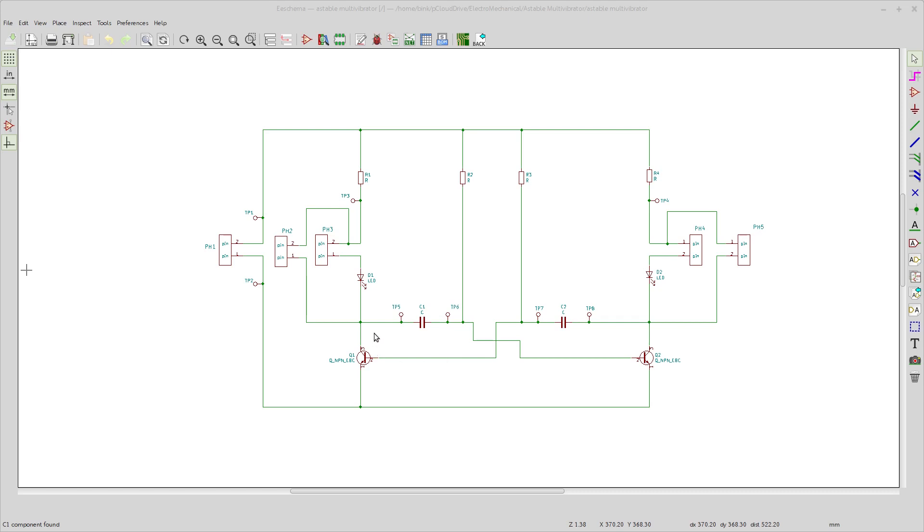The thing that is different here is this particular pin header one over here is going to be just a two-pin through-hole input that I use these little test pins. They look kind of like the eye of a needle — probably about four or five millimeters tall, sticking out of the board. So I'm going to use a different footprint for these than I will for the others, because these are going to be just flat surface mount jumper pads. It's just two pads, two surface mount pads, that are only about a millimeter or so apart from each other, so it'll be easy to just put a blob of solder across the two of them.